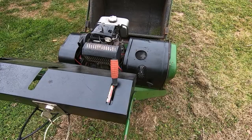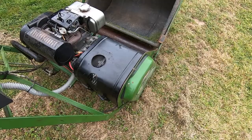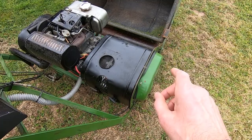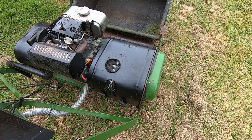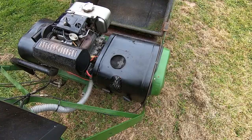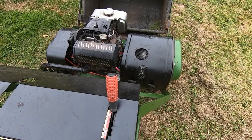The issue I want to address in this video is the gearbox. I've already replaced all the bearings — there are bearings on the main roller, a couple of hub carriers inside the green housing, and bearings in the gearbox itself. When I had the gearbox apart, I noticed the gears were very badly worn and the idler and main driven gear had severe burrs on the ends of the teeth. I ground those off, but it still makes a horrendous howling noise under load. These are straight-cut gears, so they will be fairly noisy anyway, but in this video we're going to replace the gears in the gearbox.